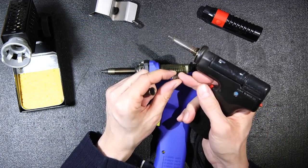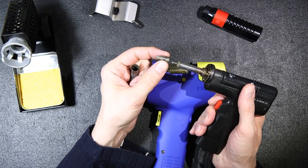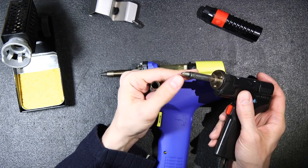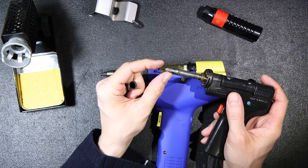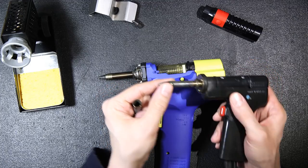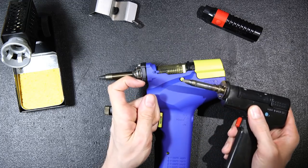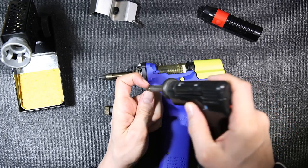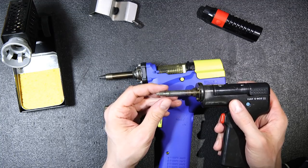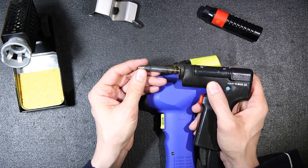I've got lots of these older tips that are good, so I'll just keep those for the newer machine. I also find that the diameter on some of these older tips — there are lots of these around and you can get some very large diameters. One of the nice things is that these tips are very, very tough. Like with the soldering iron, you never want to use any of these things to pry or bend up leads — it's tempting, believe me. When you have a lead folded over on a circuit board, you kind of want to use the tip to pry it up. So it's always good to heat it up, bend the lead up, and then go in and desolder it, just to extend the life of the tip.